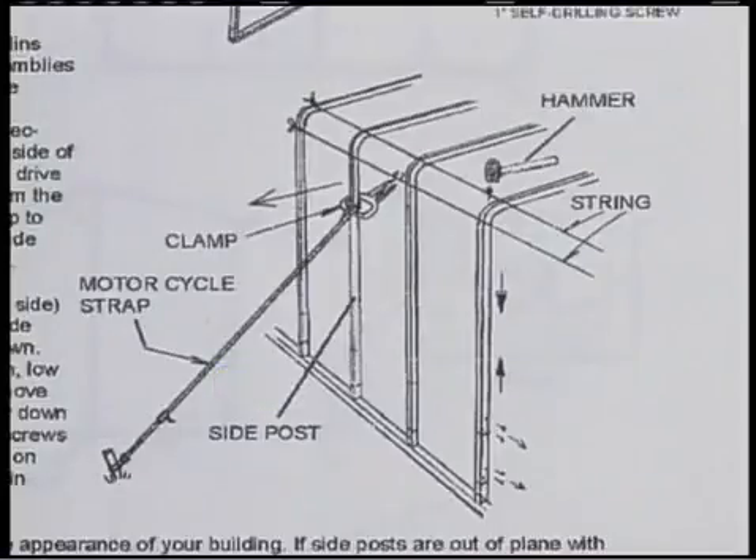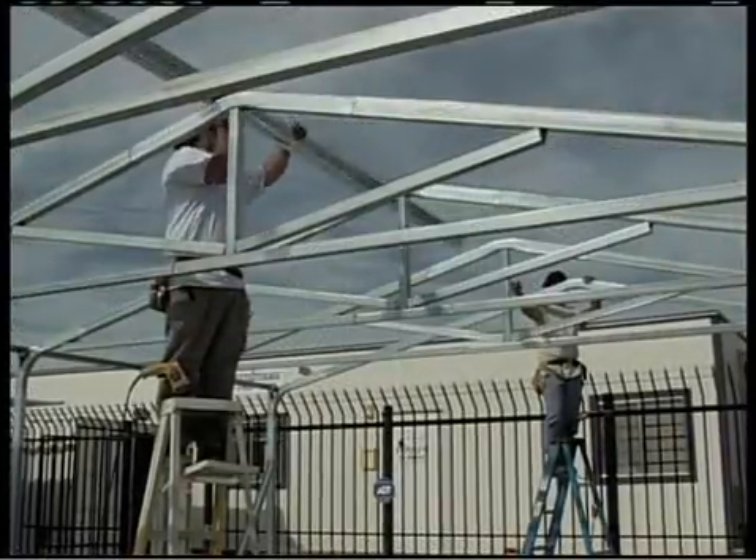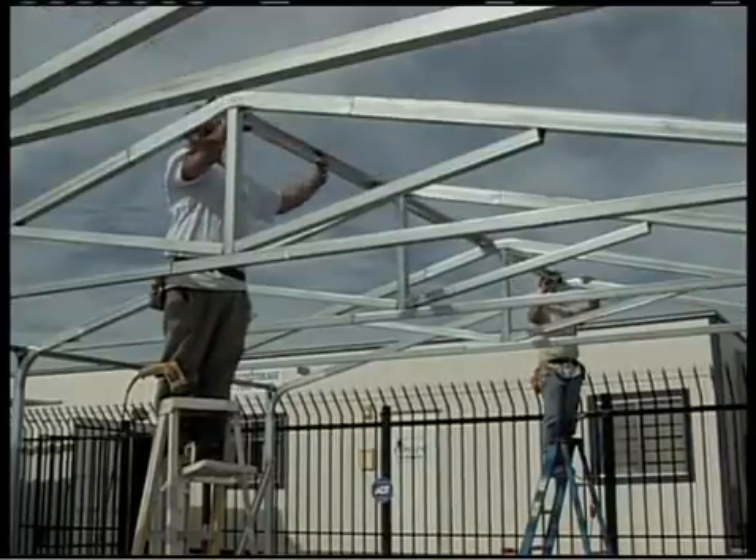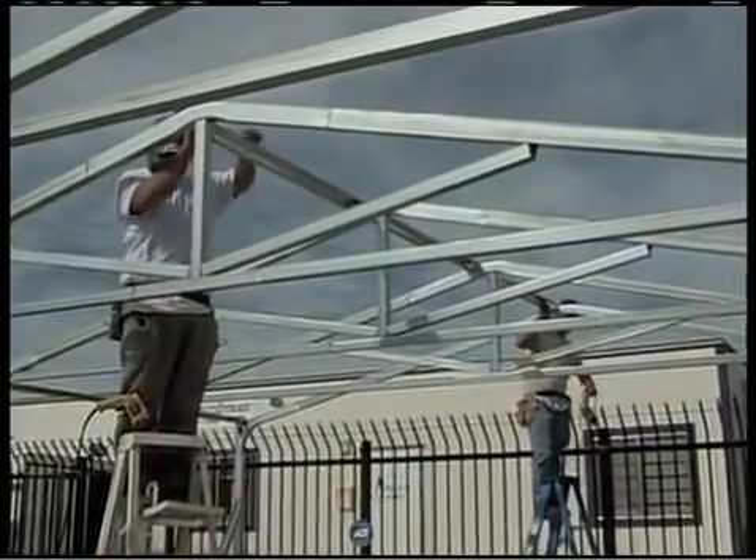Something we've found very helpful when installing a Sierra — which is what this building is — or a Mojave or Teton style building, is that when we need to straighten things out, do a bit of tugging or pulling, or adjusting as we just explained with a Sonoran or carport, we keep all that in place by installing a row of hat channel next to the eave and at least one row near the peak to hold it all in place. Or you can accomplish the same thing by installing one row of hat channel at the eave on both sides, as you'll see later in step 13.